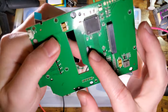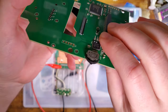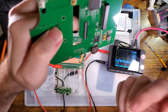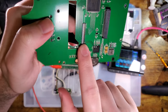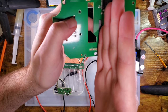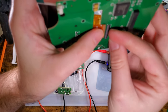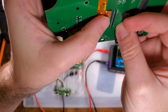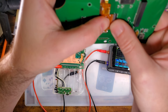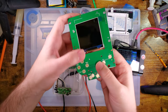Before plugging that in, I just want to discuss this flat flex connector real quick. Cloud Game Store likes using these — I don't know why, I hate them. Maybe they got a bulk deal, or maybe they just really like them. But either way, these are a little bit backwards compared to normal flat flex connectors. On normal flat flex connectors, you insert the bail on the front and then insert the cable on the front. But on these, you actually lift up the back and then slip the cable in the front and close it like that.